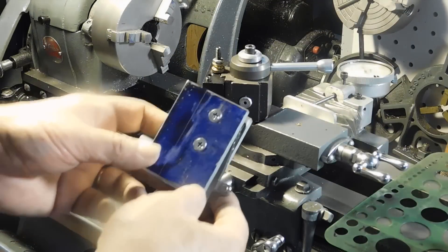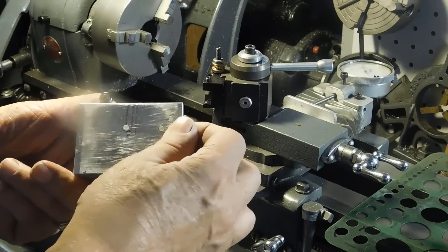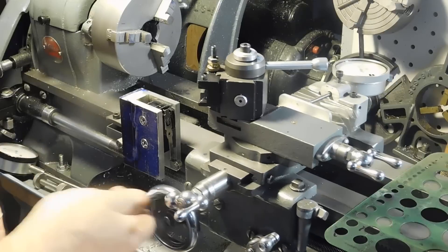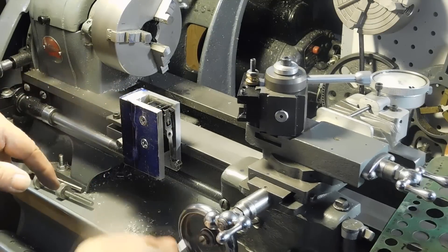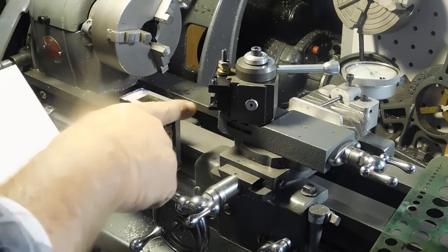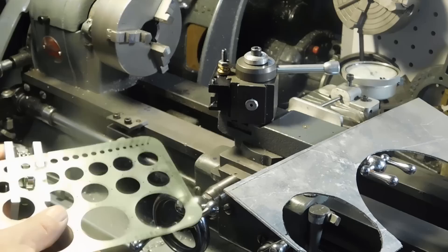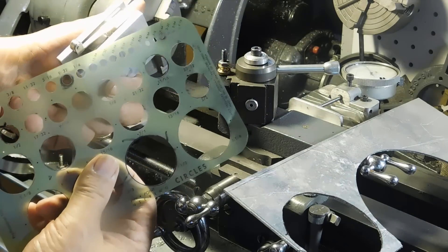This is as far as I got. I tapered out these things so I can fit the limit switch in there. The limit switch is nice and tight and doesn't move around. I cleaned off the back a little bit and pressed in the dowel, so it just kind of slips right in here like that. You tighten the edge here and it shuts it off. What I need now is a cover. I'm going to use this piece of aluminum and make an L-bracket with a hole in it — a 9/16 hole in there should do it. Let me go cut out some aluminum.